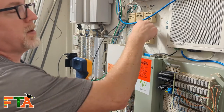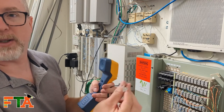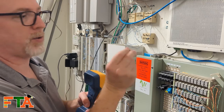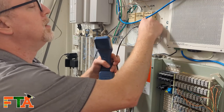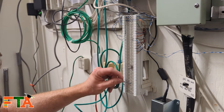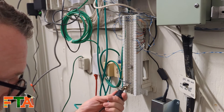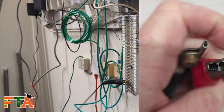RJ11 on this end. Now, even though this is RJ45, an RJ11 plug will go into it because it's going to touch the center pins — phone jacks and phone ends use the center two pins. Even though one is RJ11 and the other is RJ45, it will still work. There's always a pair, so it's always two conductors. You can look in here and see right where the conductors are, so I know it's going to be this one and this one. I'm going to put one angling up. Okay, there we go. Sometimes it's a little tricky to get on it.